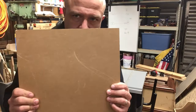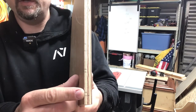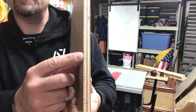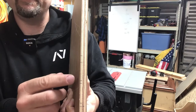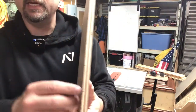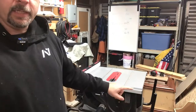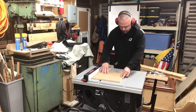This is going to be the two side pieces. You can see the bottom accessory shelf, the top accessory shelf, and above that a half-inch shelf to hold the router itself. I want to cut dados all the way down. There are a few different ways I could do it — with a dado blade on the table saw or with a router — but I don't really want to spend a lot of time setting stuff up, so I'm going to use just the regular table saw blade, raising it about an eighth to three-sixteenths of an inch.